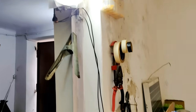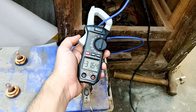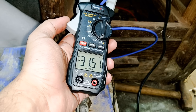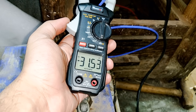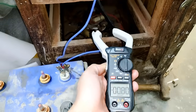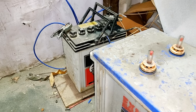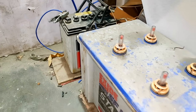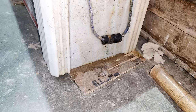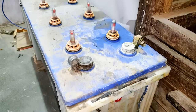Now let's do the battery amps measurement. The amps drawn are as high as 32 amperes, which is quite high for the 4mm wire cables — that is exactly why I recommended thicker cables up to 8mm or 10mm. There is one more thing you need to make sure: keep the batteries on some wooden or plastic platform, which will further reduce self-discharging of the battery.